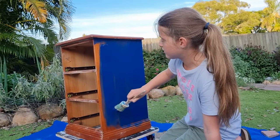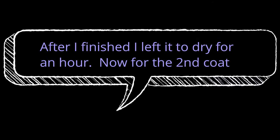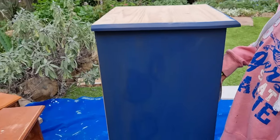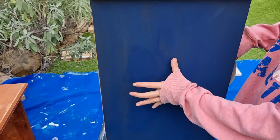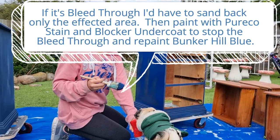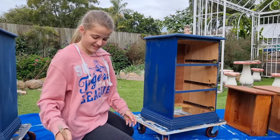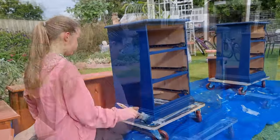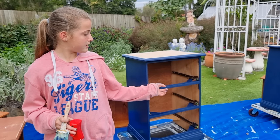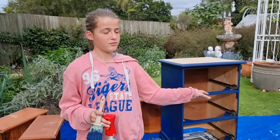I really love not having to use an undercoat because it's just a lot quicker. Okay guys, so the paint is finally dry and I lightly sanded down with my 400 grit. But before we sand it down, as you can see there are big blobs here — I think it's just because we added extra paint, or it might be bleed through, but I'm just hoping it's extra paint. So I painted the inside of my bedside table because I want it neater, so when you open the drawers you can't really see the drawer under it.